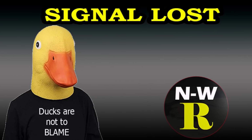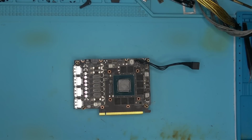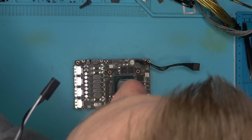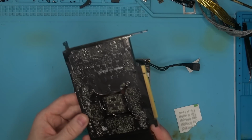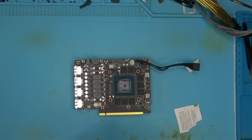So I'm going to have to throw this thing into an ultrasonic. That's going to help a lot with breaking away all that rust. Not necessarily remove it, but it'll get it loose, and then I'll go in with the electronics contact cleaner, finish it off, and hopefully that would be it. And my guess is that this card here will have, yeah, the ports in there look exactly the same, so it'll probably have the exact same issue.